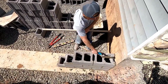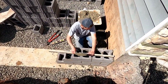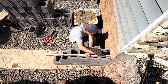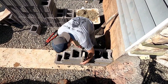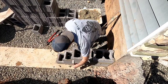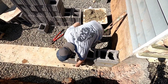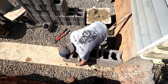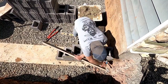Third course is set. I got my rebar holes there — you do the same thing all the way up. Just level this part and make sure your level hits this height mark over here. Plumb — already good. Don't get your level messy. Always match up your head joints. Chase back to your foundation, make sure it's clean.